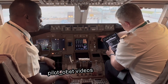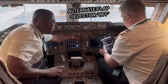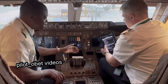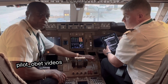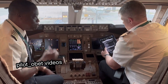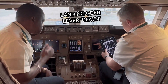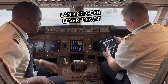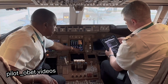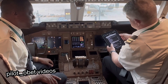Alternate flap selectors off. Alternate flaps on this aeroplane are electrical, so if we power it up and the AC power and everything's powered up, the flaps could start moving or the leading edge flaps could start moving. So we make sure that's also off to prevent damage or injuring somebody outside. Landing gear lever — down. Flap position indicator and flap lever — agreed. It's up and it's indicating up, but that's because there's no power at the moment.